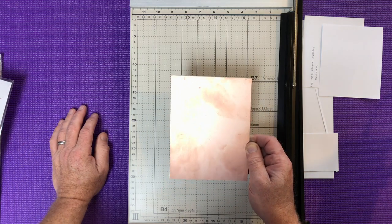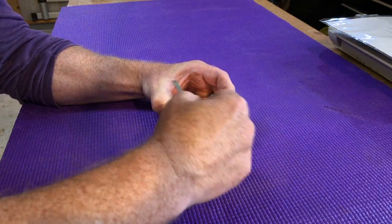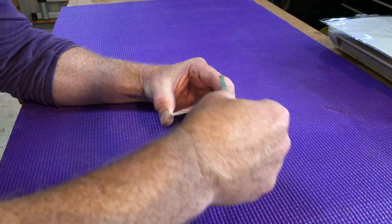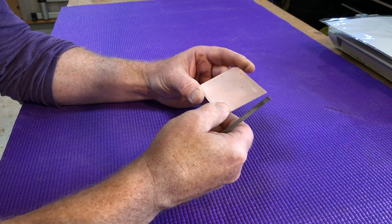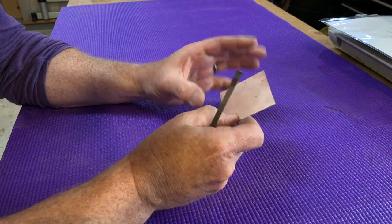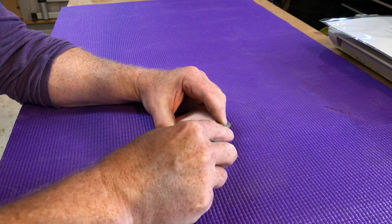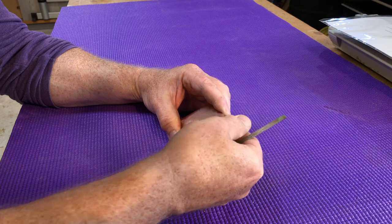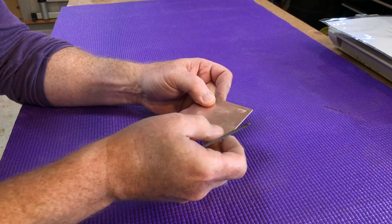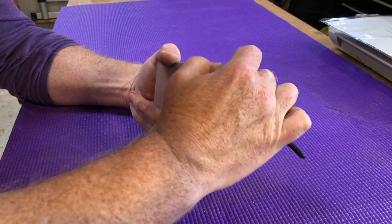When you cut the board edges, even after linishing, you get a very sharp burr on both sides from the fibreglass. The corners are also areas of problem, so just take a little rounding off them — because we're going to be sticking this through the laminator in all sorts of angles, those nasty sharp bits are areas of concern.